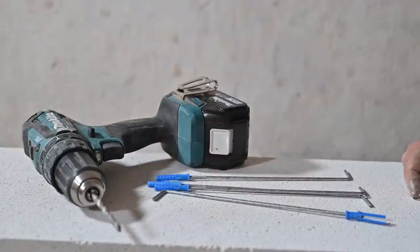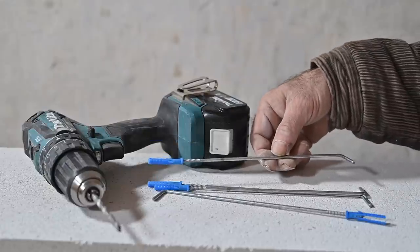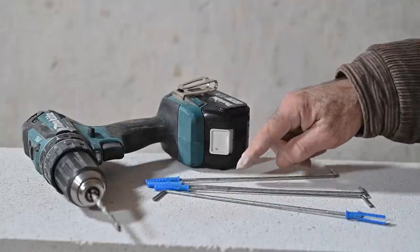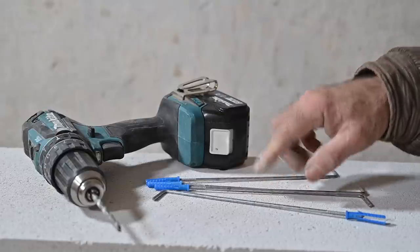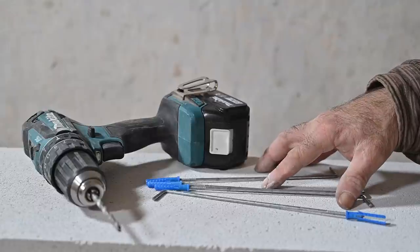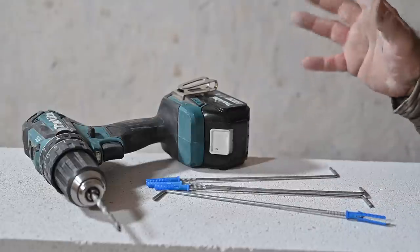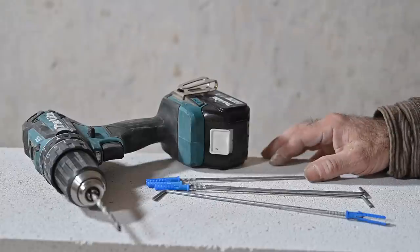Now it's time to lock the blocks to the outer wall. I'm using these rods or hooks that go inside the outer wall and then rest with a little hook onto the cellular concrete — that way you can secure the inner wall to the outer wall. I use them about every two layers of cellular concrete blocks, spaced about every 45 to 50 centimeters into the wall, which makes it very strong.